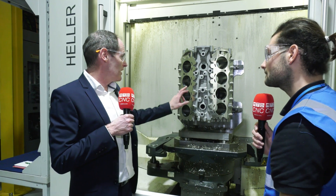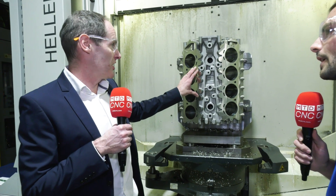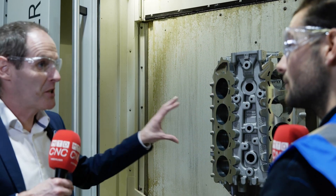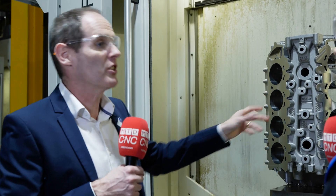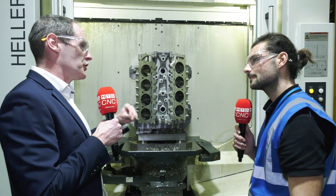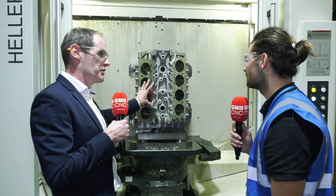There are a lot of critical requirements on the surface finish. You actually don't require a brilliant surface finish on these faces — you actually want it rougher. You don't want a mirror finish at all; this is almost too good. But this is not the finished article at the moment, so this will actually get roughed up further down the line. The specifications on the drawing tell us exactly what we need to achieve on these faces.